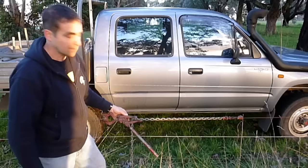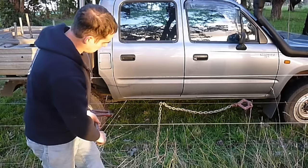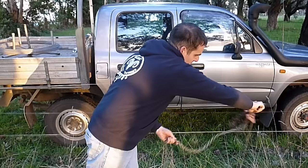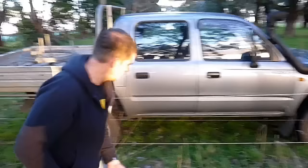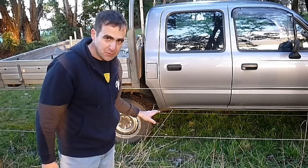And there I am left with my strainer knot assembly. The beauty of this knot is that I don't have a lot of slack in the wire, so when I take my strainers back down the chain I only lose about a link of tension — you tend to over-tighten your fence by that link to make up for it. Now I have a fully strained knot and I can simply knock the other end of the strainers off — and that will fall off the wire. There I have my fully strained fence. I haven't had to spend five dollars on a gripple or two dollars on a crimp. By the time you do that a hundred times you've spent a lot of money you don't need to. It's a really good plan to learn how to tie this knot and do it really well. Thanks guys, I hope this has been useful for you.